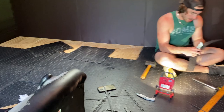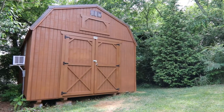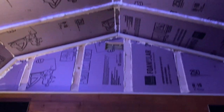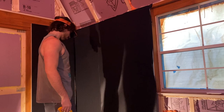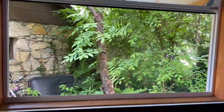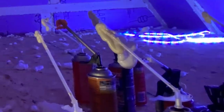The outside of the shed was stained a nice darker brown color. We got that same stain and applied it to all the places that would be visible after finishing the walls inside. In the corner that was going to become the recording booth, we put acoustic batting underneath where the fabric walls were going. We also got an AC unit from Amazon, put it into one of the windows using spray foam, with a little stand in the back for support.